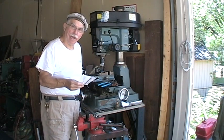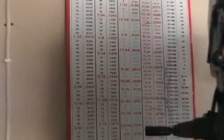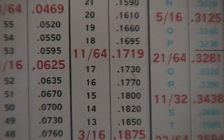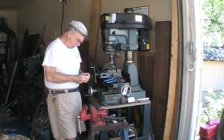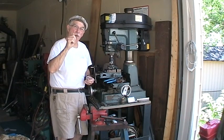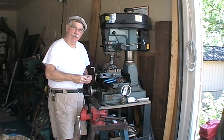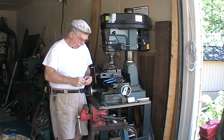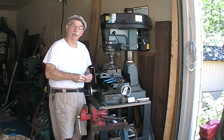I should do a graphic to show you that. A 0.177 drill, looking at my handy chart, that's a number 16 drill. I checked my math a couple of times and it didn't seem intuitively correct that you'd have to drill two holes at 0.177 to get the same area as a 0.25 drilled hole. But that's the way it works out because of the squares involved in area calculations. I have to drill 0.177 twice to get the area of a 0.250 hole.